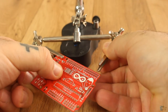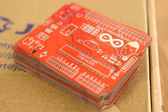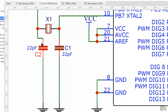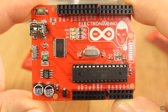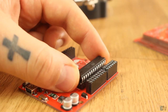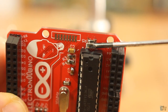I've received my boards. With the schematic on the side I start soldering the components. The board has great silkscreen so I can see the name of each component — for example, here is the C2 capacitor. I go to the schematic, see its value, get that component, and solder it to my PCB. Do that for each component. Now everything is soldered in place — it's time to add the ATmega chip. Be careful not to put it backwards; check pin 1 marked with a dot on the corner, matching the dot on the silkscreen of the board.